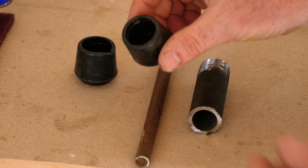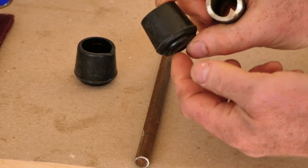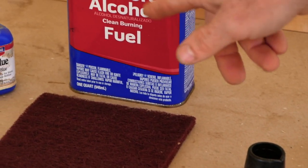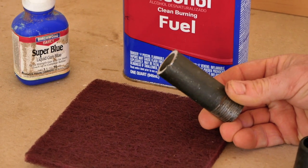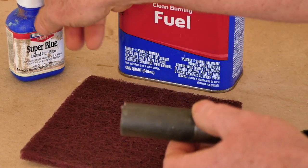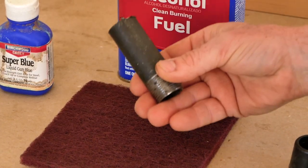I've got rubber caps that go onto the bottom of the pipe so it doesn't scratch the floor — remember these add thickness, so you have to cut your pipe a little bit shorter. I've got a scrubby pad and denatured alcohol to clean up the steel pipe. Black pipe comes in oiled and lacquered; the lacquered kind is really hard to strip — you need chemical stripper to get the lacquer off, then gun blue to blacken it again, which is a huge pain. So try to find black pipe that's just oiled and not lacquered. You'll also need a drill press for this — trying to do it with a hand drill is going to be pretty frustrating.